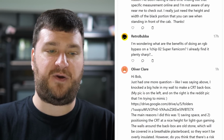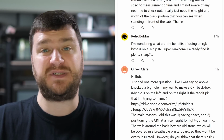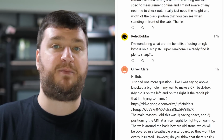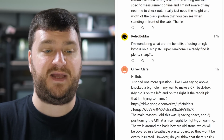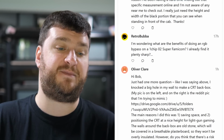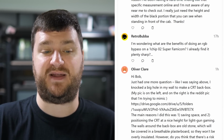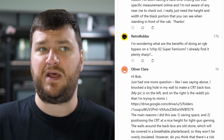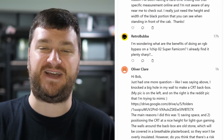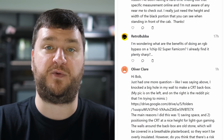But for now, I just kind of would leave your original Super Nintendos alone, and your one chips, probably just leave it alone. If you had any concern, do a cap replacement because it's not too hard, and that way you could make sure that the original isn't leaking. You don't have to worry about the original caps, and you might get a small boost in quality just from doing that. But honestly, if it's working, you don't have to do anything. Just, as always, pop your case open, look in with a flashlight, and make sure you don't see any leaking caps. But if that's not it, then I probably wouldn't do anything these days and just wouldn't worry about it.